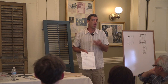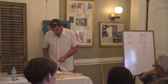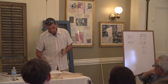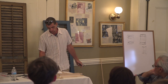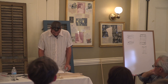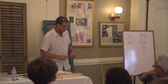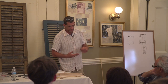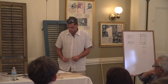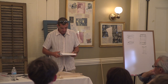The only thing about shutters is that they're not particularly susceptible to insects — your windows and doors, however, are. A lot of this will carry over to any wood aspect of your house, whether it's your trim, windows, or doors. All the keys in the cycle of decay require water. There's not any of these things that can happen without a source of water. So if we can stop the water, we can pretty much make these things last forever.